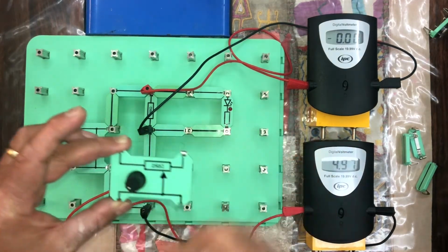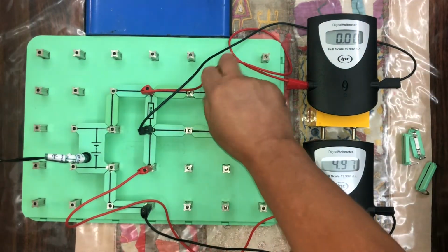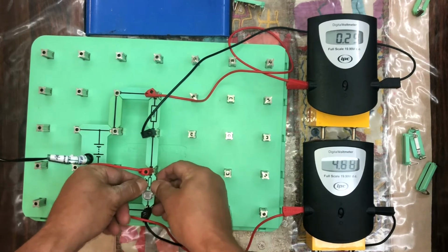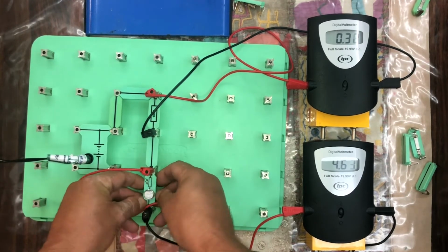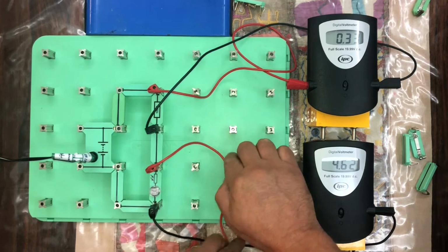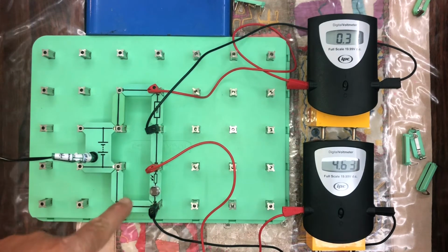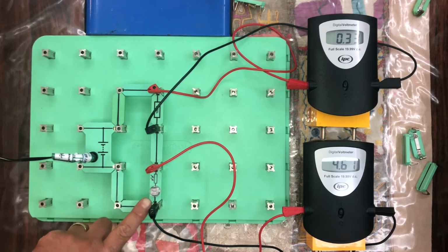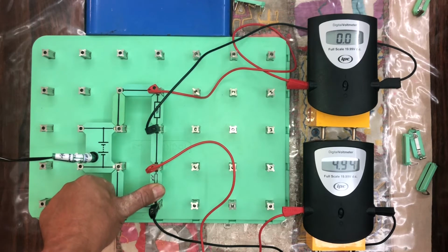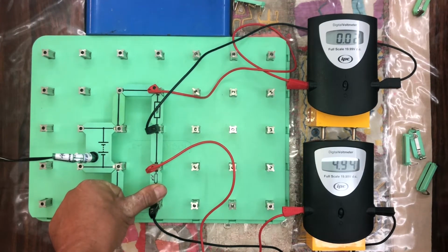Right, this is what I was going to do before. Variable resistor. Even more useful would be another type of variable resistor, but one whose resistance varies automatically. Okay? No prizes for guessing that this one is an LDR. Okay, a light-dependent resistor. A resistor whose resistance changes depending on how much light is falling. Now, at the moment, we have bright conditions, and if we put our thumb over it, we get dark conditions. Now, not a great change there.